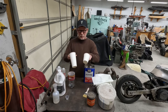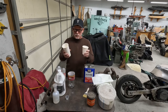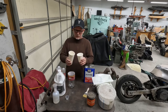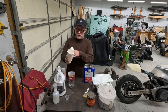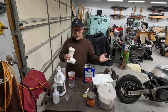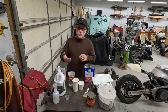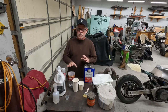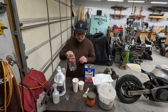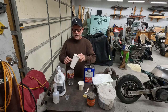I use paper cups — I buy them in bulk. The paper cups I use do not have wax in them. Do not get cups with wax because when you're mixing materials and scraping your stir stick inside, you can scrape the wax off and contaminate the material. When you go to apply it to your part, wax particles will repel any kind of paint and you'll get fish eyes and other problems. So use plastic or paper cups that do not have wax — when cups have wax they're usually obvious, they'll have a plastic-looking coating inside.